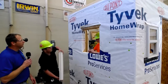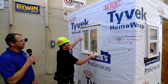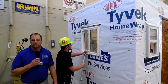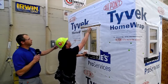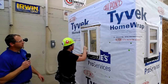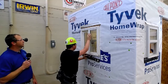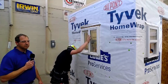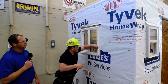On a new house, after you get the wrap on the outside of the house, you're going to have to install the windows. What they're going to do is make sure that the windows are plumb and square. Plumb means straight up and down. He's using a level right now to check for level, and he'll check plumb after he gets a nail in. Brandon is on the inside putting a shim underneath the window to make sure it stays horizontal.